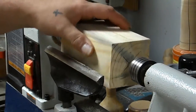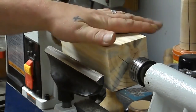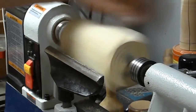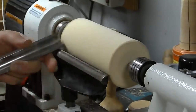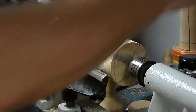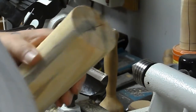My thought is I need the chuck to be able to move and clamp down on the spoon bowl. This is a three-inch by three-inch piece of pine, and right now my biggest concern is just making this round. So I'm going to make this round and then I'll start talking again. We're round now, and I plan on making a two-inch outside diameter bowl spoon.